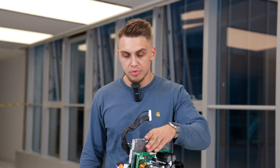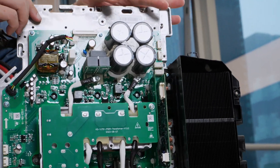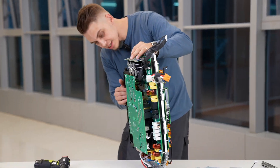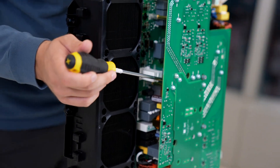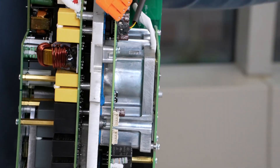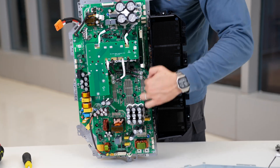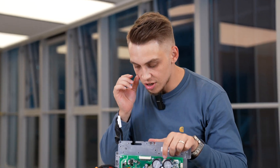Here is precisely how the X cooling system works. Aluminum is obviously a very good conductor for temperature. You see this aluminum box right here — the one on this side and another one on the other side. This box contains particularly hot parts like inductors and transformers, basically parts that have very high heat loss. The whole box is filled with heat conductive glue. All the heat from the parts goes into this aluminum board and then flows into the copper plates — there's fluid flowing inside of them. They go to the radiator, and then those fans sitting under the radiator blow all the heat all the way up.